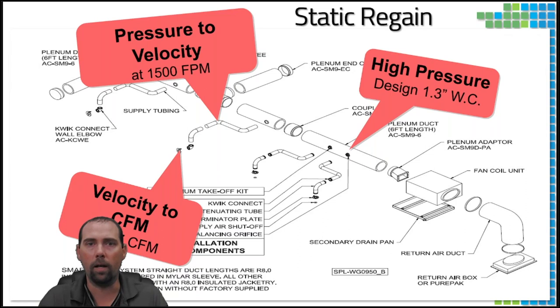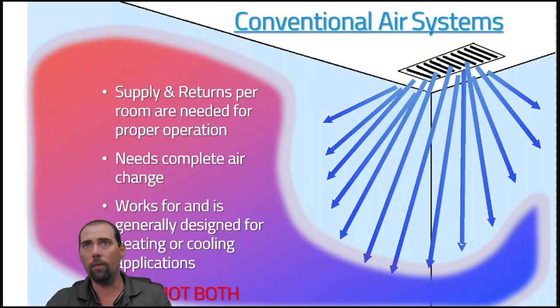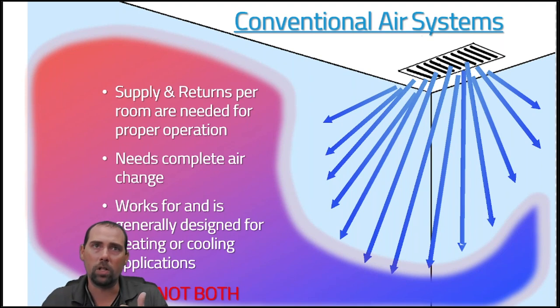There are rules to follow to stay within our sweet spot for duct sizing. If we measure all our ducts and do things correctly, we'll see that 37 CFM number. We may sometimes need extra ducts to deliver the required BTUs. In a conventional system, we typically have diffusers in the ceiling — maybe eight-by-eight metal grills — floor registers for heating, and returns throughout the home.